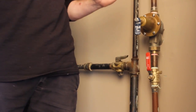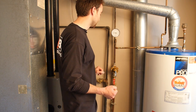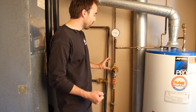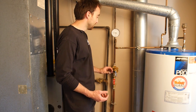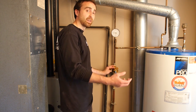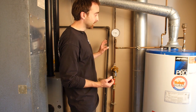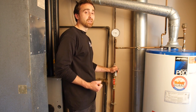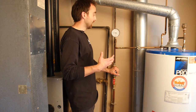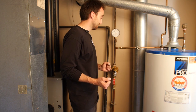Above our shut-off is what's called a PRV. This is something we want to have access to, and it's actually one of the most important components in your plumbing system. PRV stands for pressure reducing valve — it's a valve that lowers the pressure of water coming in from the district or city to a good operating pressure within your household. You don't want high pressure going to your washer, your dishwasher, or any fixtures, because they're not designed to accommodate that pressure.